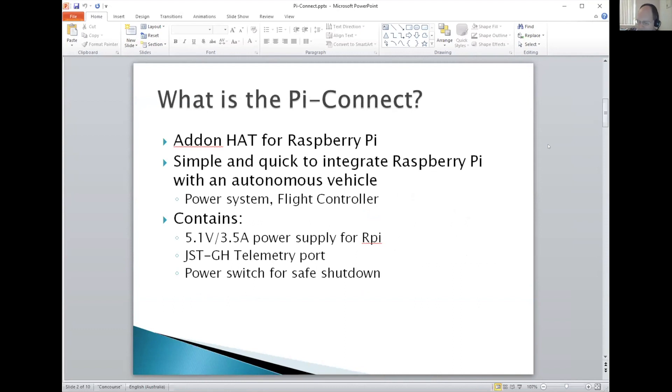This was actually inspired by the 2018 UAV Challenge. Our Porter that we flew had a Raspberry Pi in it for image analysis, and one of our big issues was that a serial port line vibrated off during the middle of the flight. That was the inspiration — to make a dedicated board with positively locked connectors, so people didn't have to create their own solutions.